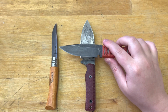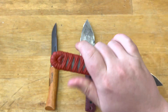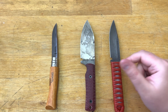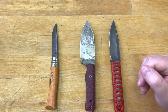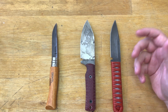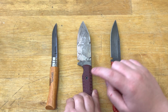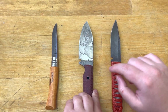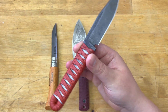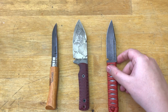People have this misconception that a low quality steel is the one that rusts, but I would disagree, just because the attributes on these are awesome. Good edge stability, great sharpening, edge performance. It's a simpler steel, so comparatively to some stainlesses, the way the edge breaks down is way more enjoyable, and you can strop them back. Your simple stainlesses, unless it's a 14C28N, will not strop back, whereas these carbon steels will. These will strop back really well and easily.